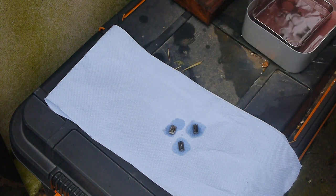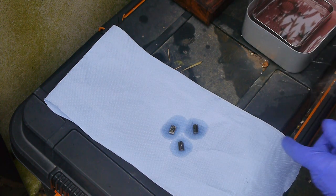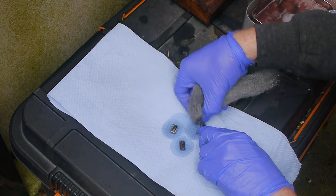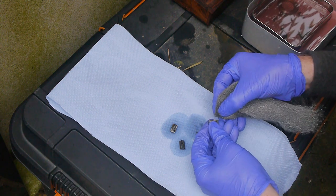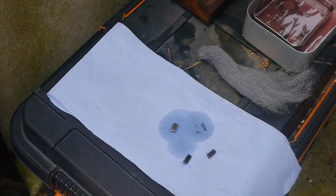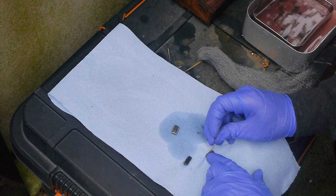To keep the surfaces looking as original as possible, I removed the rust using very fine wire wool. The kerosene helps rinse the removed rust away and makes the cleaning easier. Pegwood helps remove hard-to-reach rust and the most stubborn remaining gunk.